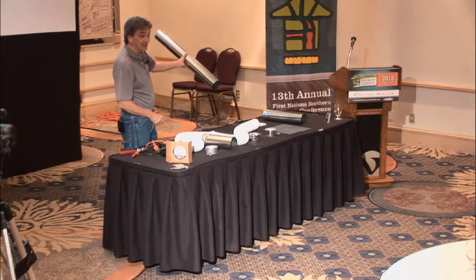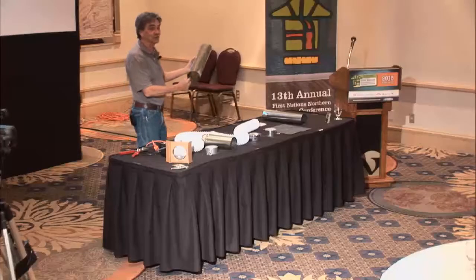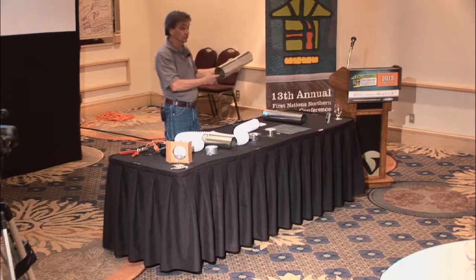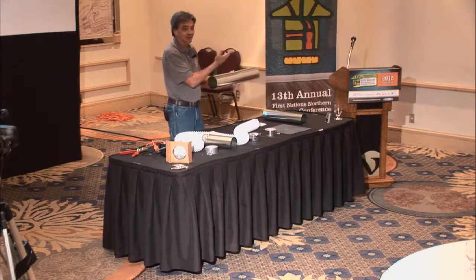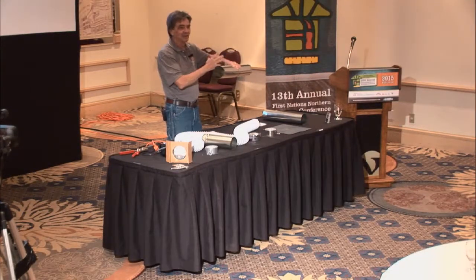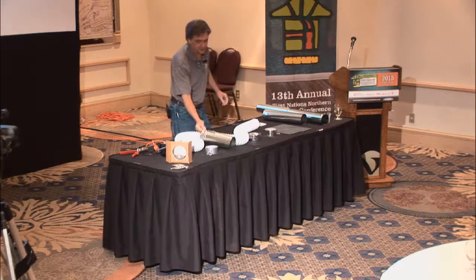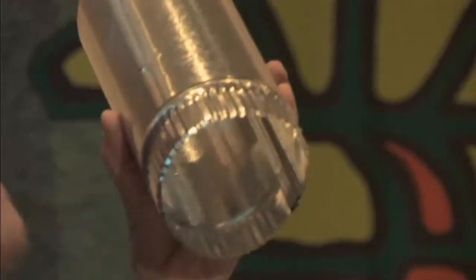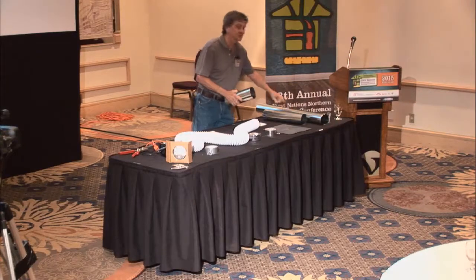If I look at the camera, there you see. You see how much air obstruction I've made? And if I actually build this backwards, you see that one works pretty good. This one is terrible because it's catching all the air in those bends. Okay? So sure, it looks good for the inspector on this side, but it's garbage on this side coming in. And so there's a real difference. Even the airflow going in this direction or this direction would be different, because one of them is basically a trap. There's pockets, and the turbulence would be terrible. The other one at least isn't a trap, but it's reduced the size.